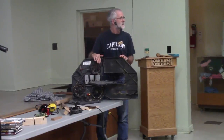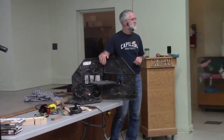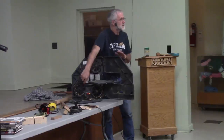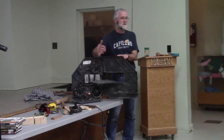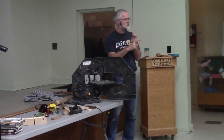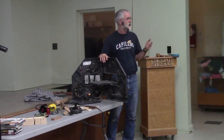Saws are all different. Some have three wheels, and actually four if you count the motor driving a fourth one. The wheel that adjusts in and out — controlling tracking angle and tension — might be on the side on some models. There are three- and four-wheel bandsaws. Whatever your saw, you need to find where the tension mechanism is, and where the wheel-tilt tracking mechanism is.